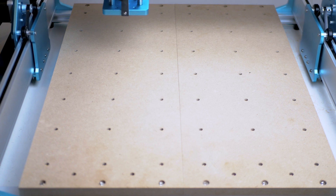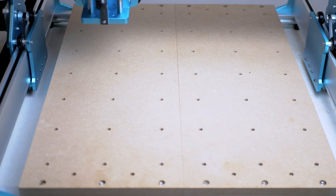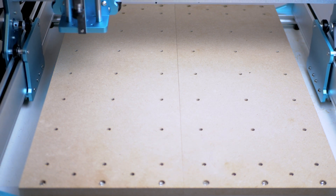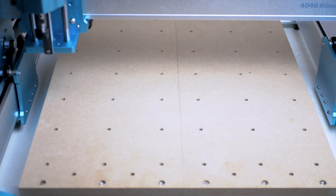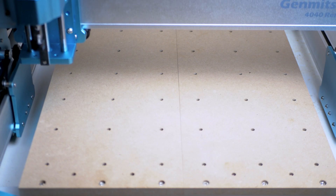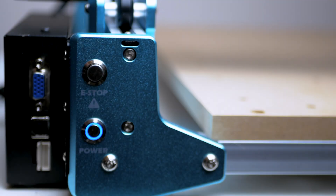As the name suggests you've got a 40 by 40 centimeter active working area and a built-in MDF spoil board with recessed nuts, though I would always recommend adding an additional spoil board on top to fit your needs as a first project. For onboard controls we have a power button and the all-important emergency stop, along with ports for USB, COM port for accessories and a connector for the optional offline controller.